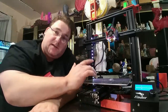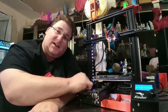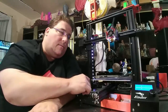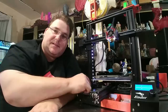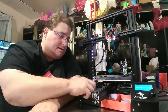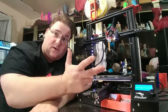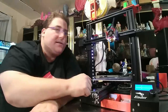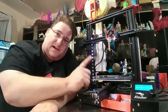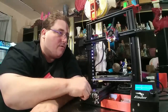If there's something you guys would like to see, let me know. From what I gather, this is an original CR-10 board in here, so no bootloader. You'd have to get a USB ISP in order to put a bootloader on there to write firmware to it. So it's not the CR-10S board, it's the CR-10 board apparently. It can run on 24 volts. I am going to replace the fan in the power supply — I was about to replace it last night and then I realized it's a 24 volt fan.